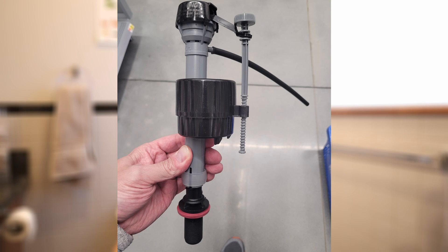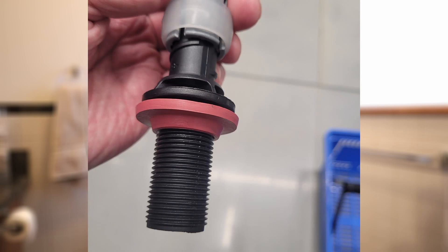The problem is the inner workings of your toilet tank are made of plastic, rubber, and some kind of metal — whether it be brass or zinc — and these materials are not designed to be exposed to water containing high amounts of bleach for long periods of time. Bleach is an alkaline, and when you combine that with the metals in your toilet tank workings, it creates a very corrosive environment inside your tank water that will actually break down all these plastic and rubber materials prematurely.